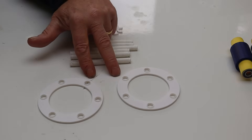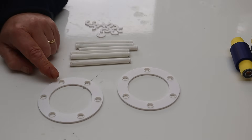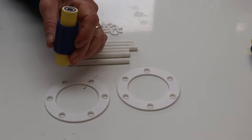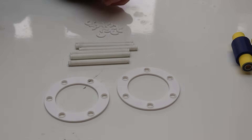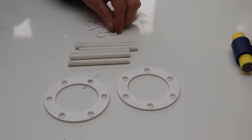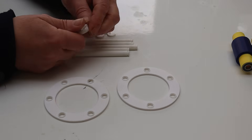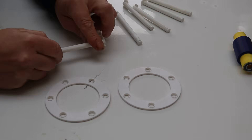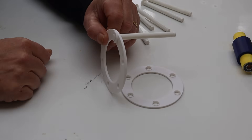The cage is made of these parts: there are two end supports, six pins and twelve little clips. You'll notice on these end supports there's a little raised section on one side — that's the side that faces the roller. It just lifts the roller away from the cage so we don't get the cage and the roller rubbing against each other. We take one of the clips, insert it into the end of a pin, then shove the pin through the end of the cage, and do that with all six.